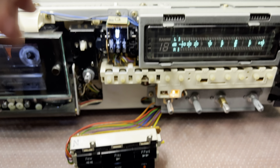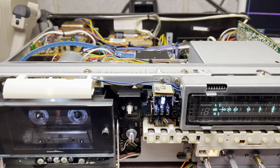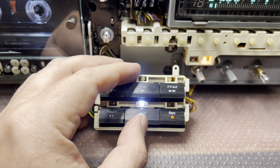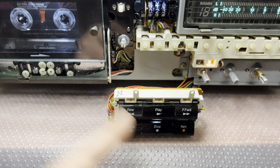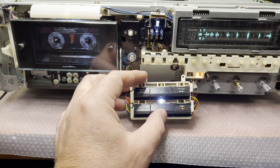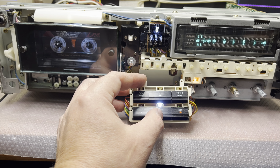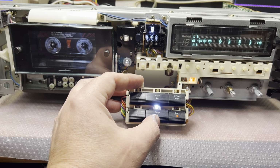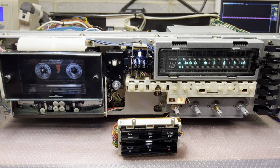So there is a resistor which is missing on the control board which needs to be installed to make this LED go dark. For all other buttons they did it, for the stop button they didn't. With bulbs it works, because a bulb produces enough current, but an LED is low current, whereas the transistor struggled to close fully. I will install it and fix it.